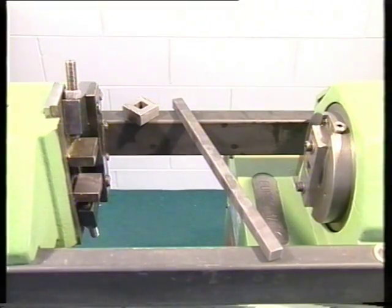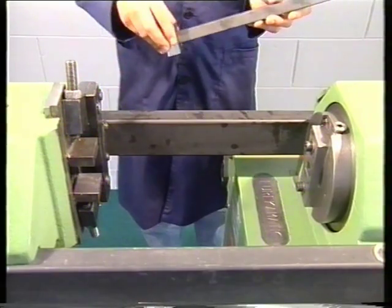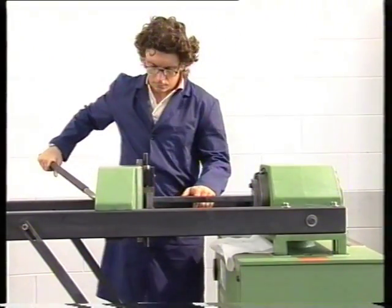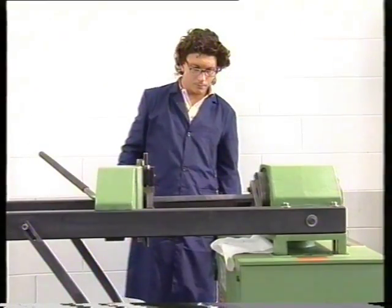The bar twister attachment is made of G22 pig iron with C40 steel jaws. It has a pre-selected number of revolutions on the control panel and an automatic return to the stroke end, so as to enable the operator to take off the blocked piece easily.